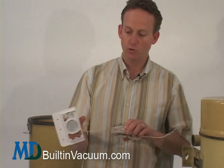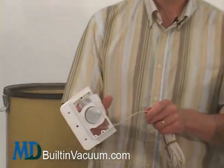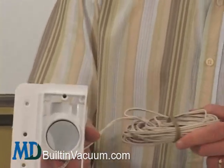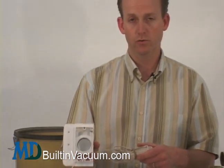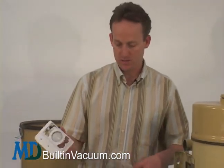About 8 inches of low voltage wire will be put into the bottom here, and that will follow the pipe all the way back to the T fitting and tie into the wire that's already existing there. Or you can run this new low voltage wire all the way back to the unit — either way, it doesn't make a difference.